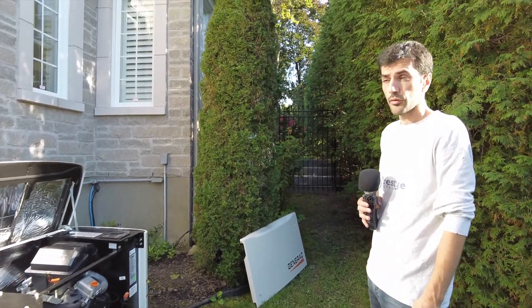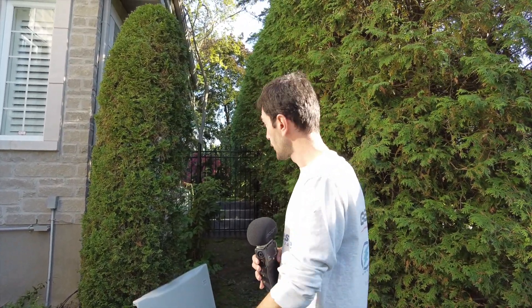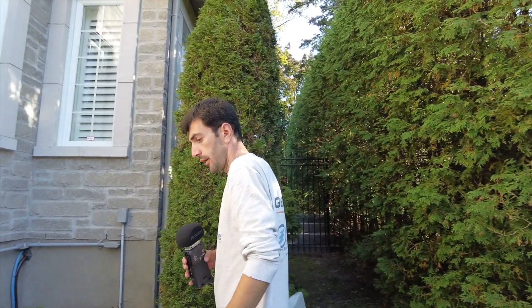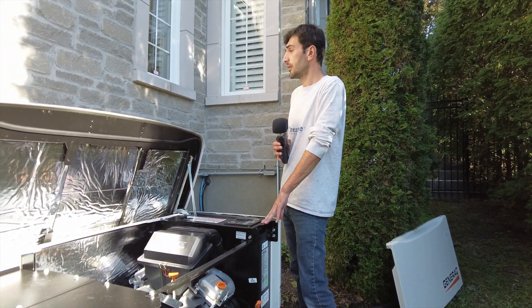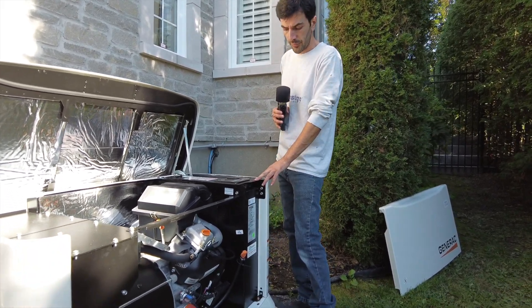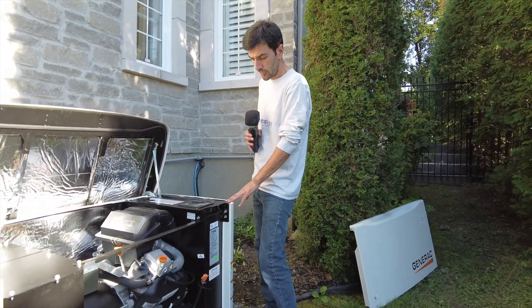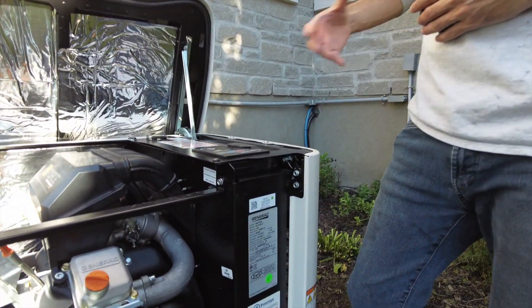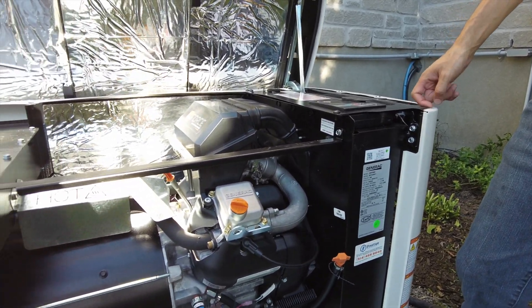The generator is one of those sources of ignition. Those two tanks are going to go all the way to the end, and then our gas technician is going to connect it to the generator. The generator has to be placed five feet from any opening or window — which follows code — and it goes on the concrete base. It's an air-cooled unit, 26 kilowatts, so the breaker is 110 amp, giving this much power to the house: 26 kilowatts maximum.